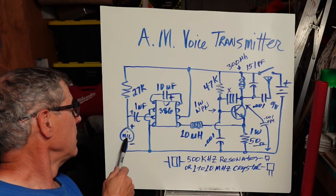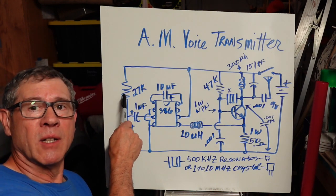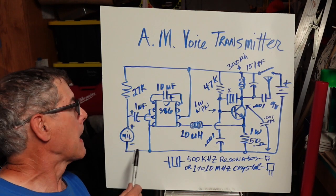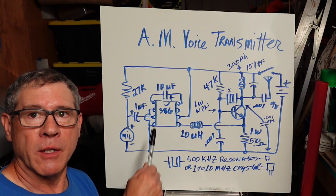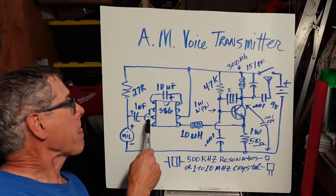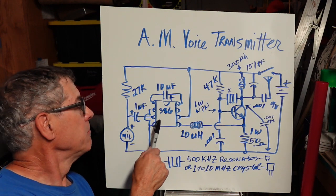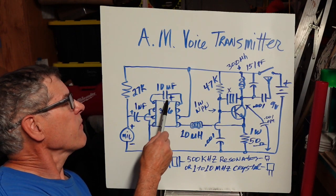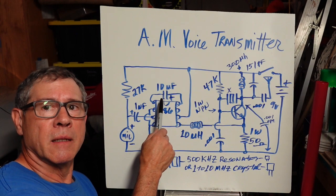Anyway, so this is for voice or sound. Sound goes in here. You have to have a resistor on top, 27K for this instance. You play around with that. And that goes into a 386 audio amp. Everybody's familiar with the 386. Now I got this FET output going into pin 3. I've grounded 2 and 4. I added this 10 microfarad up here. It changes the gain